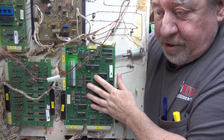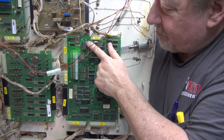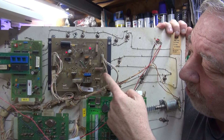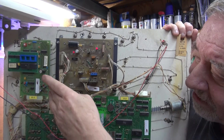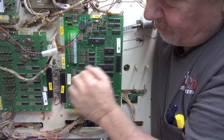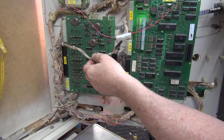We did our usual things with all these boards. We have Frank's battery board that fits right in, eliminating that horrible NiCAD battery that would leak all over the place. This has been rebuilt with all new capacitors and diodes. The soundboard has new capacitors. The logic board — we also cleaned all the connectors and got everything running. And most importantly, the driver board has been serviced.